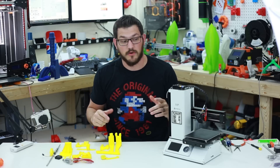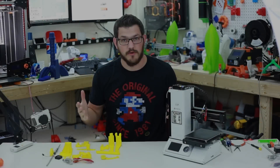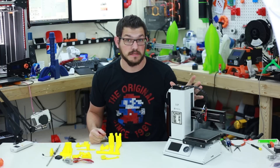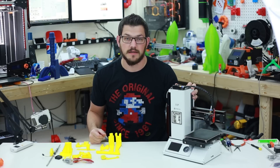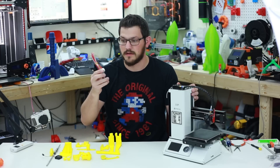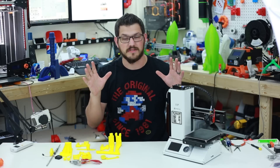What's up guys, Shane here from Figuredeck 3D Printing. Today we're going to work on the Monoprice Select Mini. It's been a good workhorse for about 10 months now, but there are some things I want to change on it and I'm having some issues with the extruder. I think I finally screwed up the PTFE lining in the throat. I could buy a new one, but I've been wanting to install an E3D V6. I have all the parts printed out. Let's go over all the parts and the other things I'm going to be doing. This isn't all the mods, but it's a good portion of them.